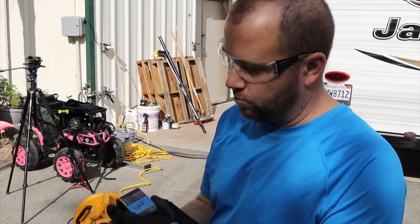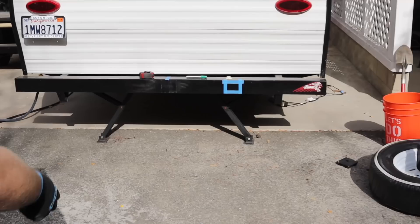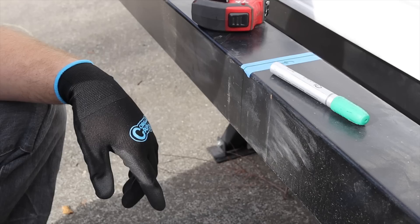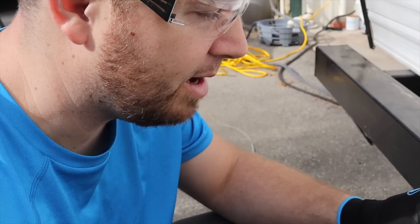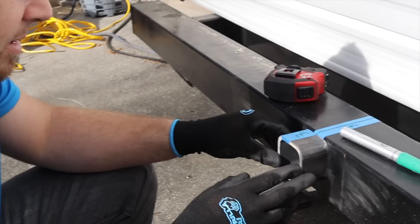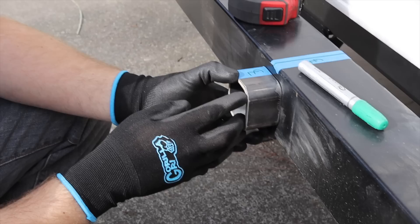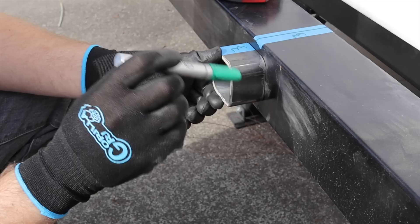I'm using a different lens — I sacrificed the other one on that close-up. We've taken our little section and used blue tape. We like blue tape — you can see it from a mile away, and if we don't like it we take it off and throw it away. No confusing lines. We're going to line it up with our other section of blue tape and really see if this is what we want: are we going from the middle of the line, the left side, the right side? That's why most people use Dykem and a scribe — you get a tiny little scratch.